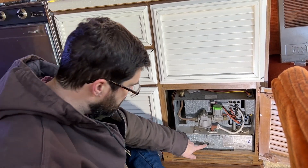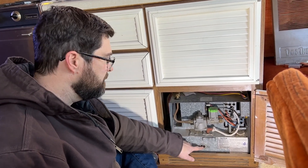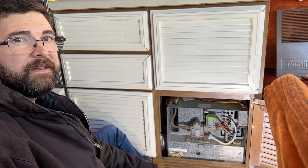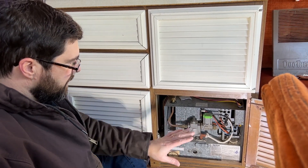The blower fan does come on, but we get no ignition from the igniter itself. I started by making sure I was getting power to it — because the fan comes on, I figured I'm getting power — but it was good to double-check fuses anyway, in case there was a separate fuse for the fan versus the rest of the system. The fan is working, but we're not getting any ignition.